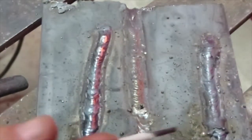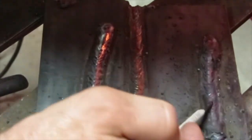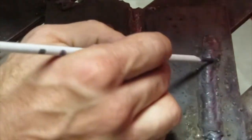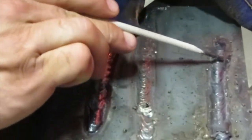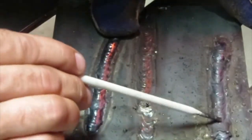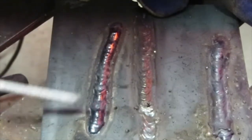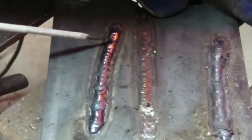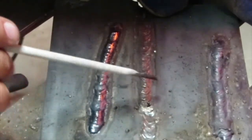So in here, this is the slag right here — this is the stuff that gets chipped off that will protect the weld. You can see it's holding tight right here; that's probably because there's some undercutting that it's holding tight to. This is a student's weld, and this one I did.